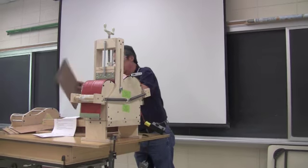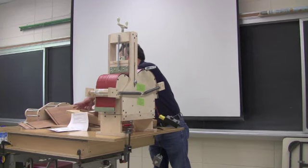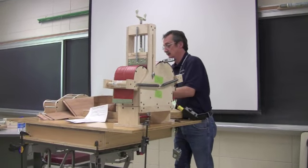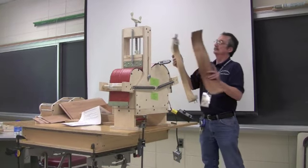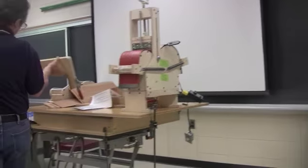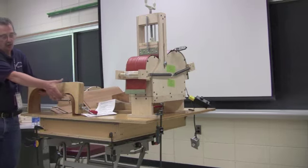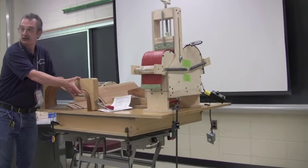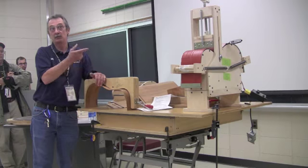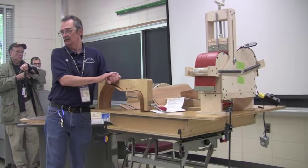When I have a set that I'm bending, and I pull it out of the machine, while I'm waiting for the other set to get bent, I will take my mold. I will put that in the mold, and then I'll just lay it down. Now this one's already trimmed, but with them being long, the weight of the mold will actually hold this up. That way it'll stay in shape till you get the other one in the mold, then you can trim it, and we'll show that probably this afternoon, how to trim, set up a mold, and get it ready for building.